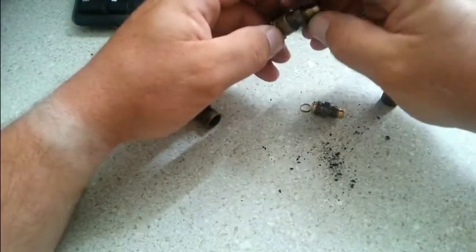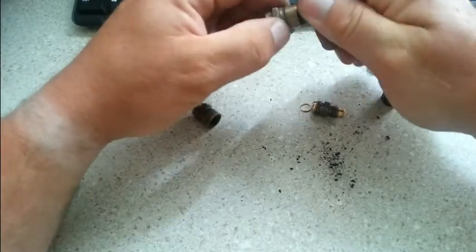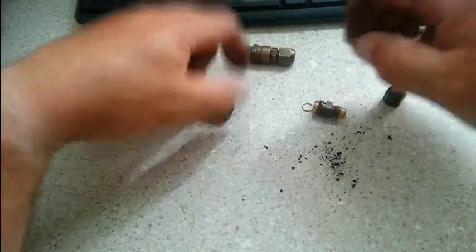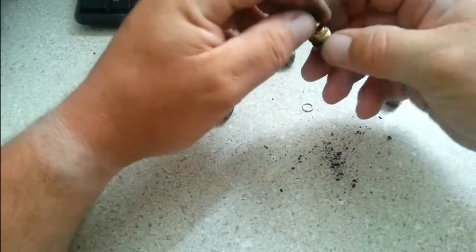So that's what we have — service valves on a Trane rooftop unit that are not standard Schrader cores. Hope this helps somebody out, and if anybody has anything to add, please post it up. Maybe several of us can learn something. We've gone through this valve, and hopefully somebody will learn something from it — if nothing else, maybe just a little extra awareness that there are different types of valves out there besides the standard Schrader valve. Spend a little time and check things out. If it's not acting normal, feeling normal, or looking normal, it warrants a little more investigation before you start digging in there and pulling parts out with needle nose pliers.